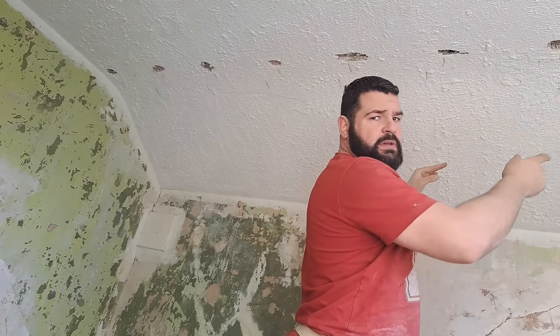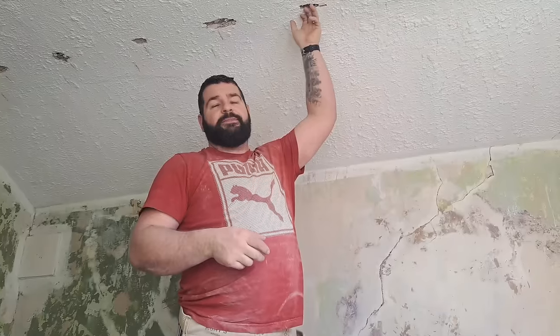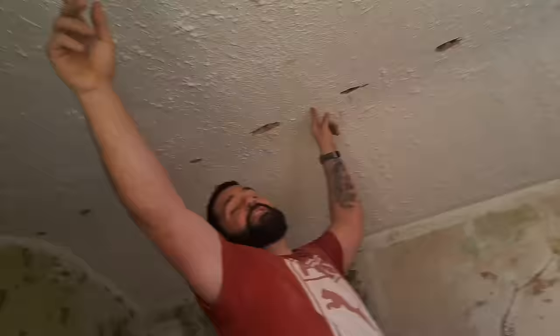On a sloping part the joists will be nailed to the side — left or right — and they can switch. Some people say you can find joists without disturbing the ceiling using little stud finders. We tried to make that work for a long time, but in older houses there's all sorts of stuff in the ceiling and the stud finder just picks up everything, giving you a nightmare. I'm telling you the fastest easiest way: make little holes, find the joists, mark them on the wall, chalk line them through. When your plasterboard goes up you can see the chalk line from either side.